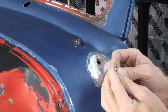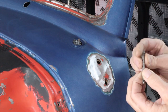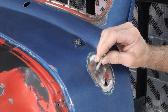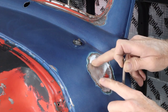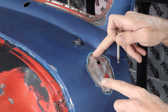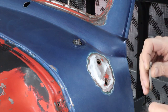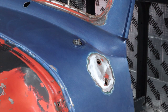I can't get anything behind it to try to spoon this out because the brace is right there behind it, tied up against the sheet metal now that we slide-hammered it forward. So we have limited options — fill it, or what I think I'm going to do is grind this all down to bare steel and tack a few bolts or threaded rod on here, then put the slide hammer on and try to slowly pull that up. They make really neat little spot welding deals where you can spot weld a small pin and pull it up, but I don't have one of those. So we'll get some bolts tacked on there and see if we can't pull that crescent up.